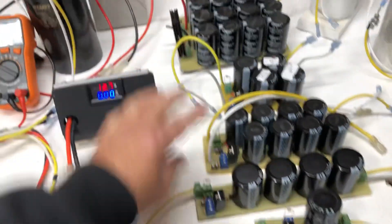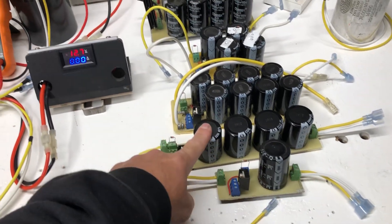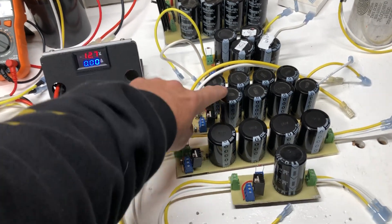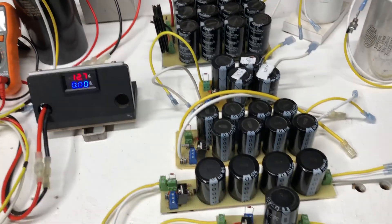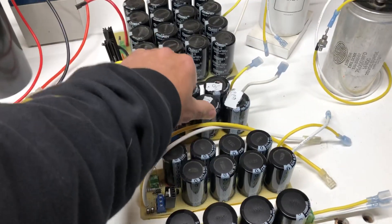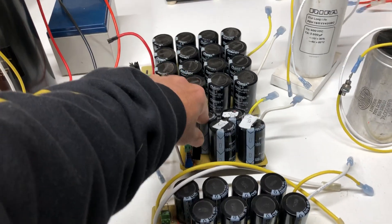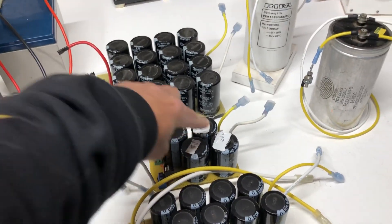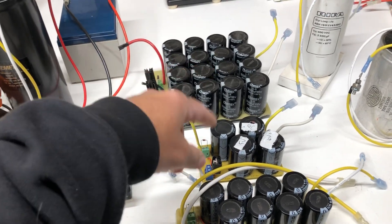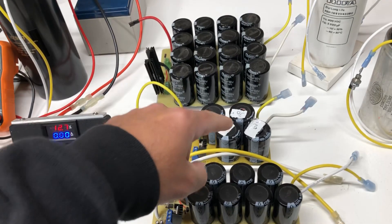SCR. This is 12 volt for 12 volt batteries and motors. This one is 12 volt, this one is 12 volt. This is actually 8 33,000 microfarad caps at 25 volts. And then these are 100 volt at 10,000 microfarads, so this one can do different voltages. I have it set up for 15 for the 12 volt, 30 for 24, and then 60 for the 48.